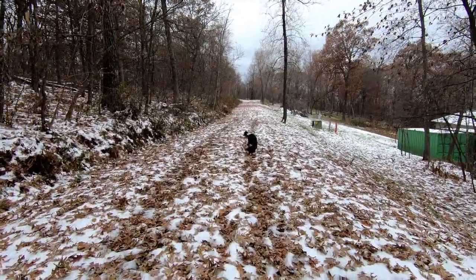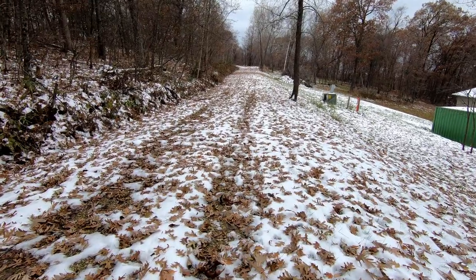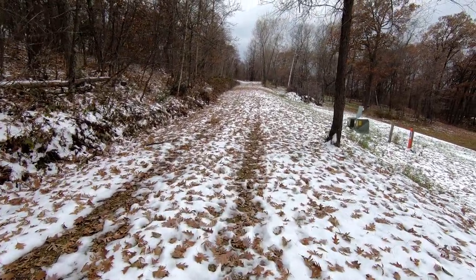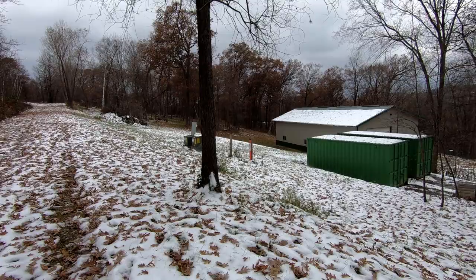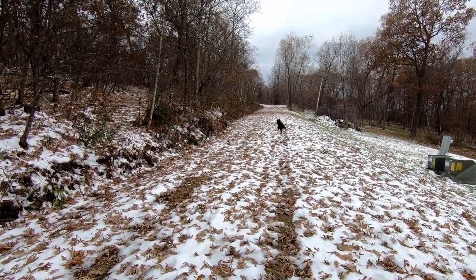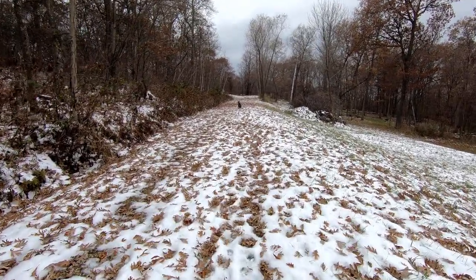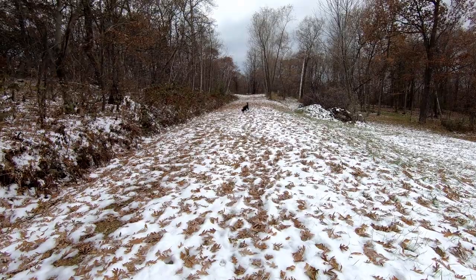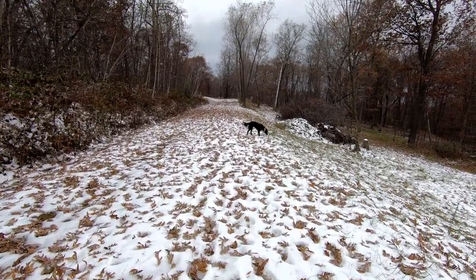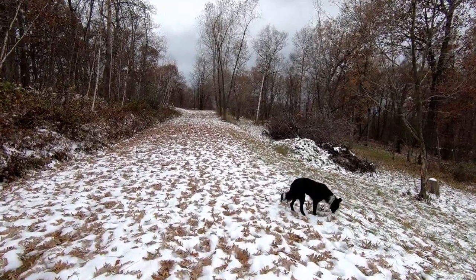If I put screws in the wrong spot, or if I put the wrong screws in, it can be fairly tragic. Most of the screws are going to be 4 and 6 inches, but if I put those in the area where the parapet is, they'll go right through the EPDM and I'll get a roof leak. So I got to get this laid out and pre-drilled correctly, and then I think I'll mark them so that I don't make a mistake out in the field. And then when it comes time to put them on, it'll be a lot easier.